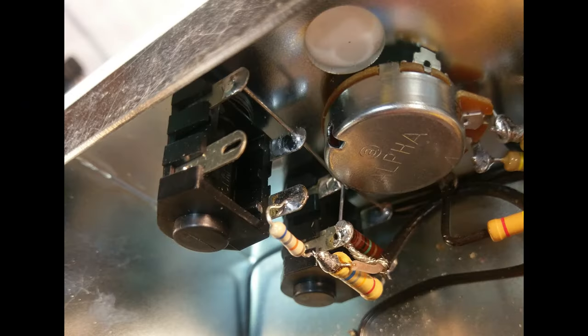I apologize, I've got a bit of a head cold. I forgot to record, but I finally figured out what the issue was. If you look at this image here on the top, there's a problem where the tip pin on the grounded or switched side of this jack was not grounded. The fix ended up being just wiring a jumper between that open tab and the back one where the grounding bus goes through, and that pretty much solved all of the sound issues. I was chopsticking around and noticed the top resistor — which was much smaller — was making a massive amount of noise just touching it. I assumed that was due to a problem with the resistor itself, so I swapped it, but that still didn't solve the problem, although it got quieter. Then solving that grounding issue resolved it completely.